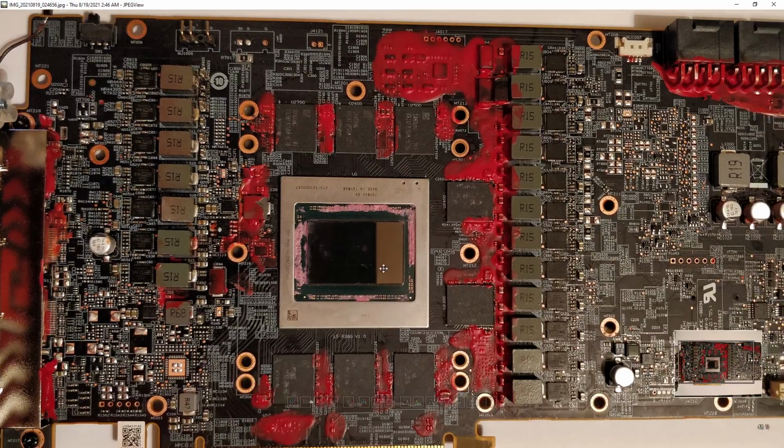And the thing is, the power supply tripping its protection when that high side MOSFET fails doesn't necessarily do much of anything, especially on a card like a 6900 XT, especially my 6900 XT, because if you have a single rail PSU, which is basically the vast majority of modern power supplies, and even a lot of the multi-rail power supplies we see today are not actually multi-rail. There's a single rail, but with per power connector over current protection, which is not the same as being a single rail power supply, because all that really means is that internally somewhere the whole 12 volt power delivery system is actually in parallel, right? All of the 12 volt power rails ultimately connect together inside the PSU.